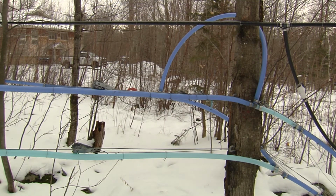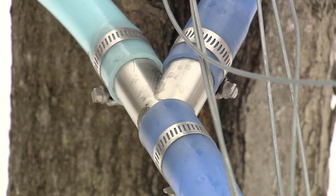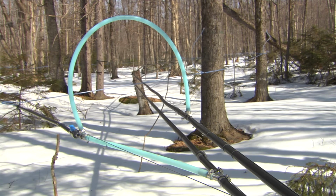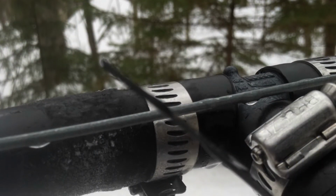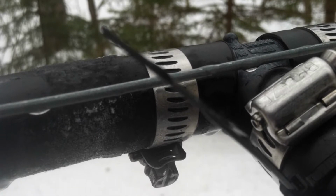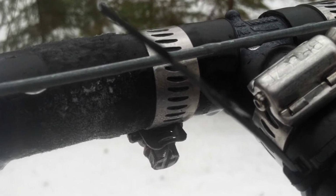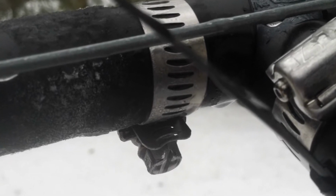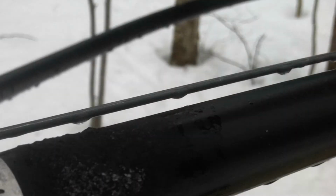Pay attention to anywhere there is a mainline connection, union, T, Y, or a lateral line entrance. When under vacuum, small leaks of air into the mainline cause localized freezing. Connections should be checked for signs of frost or for liquid leaks. These leaks are problematic because when they freeze, they'll block the leak. Once thawing occurs, the leak will start all over again. Finding these transient leaks is difficult.